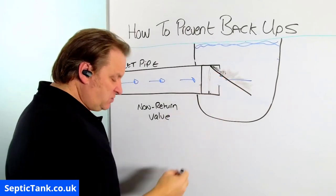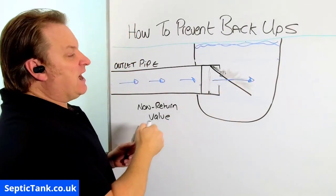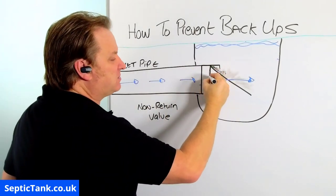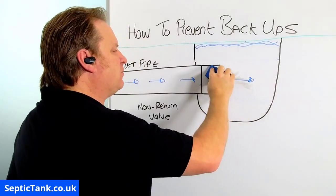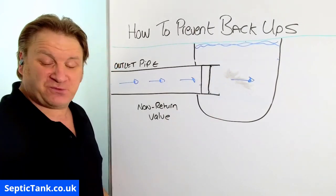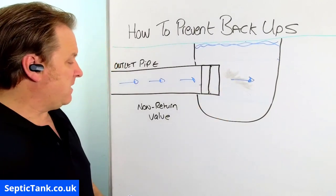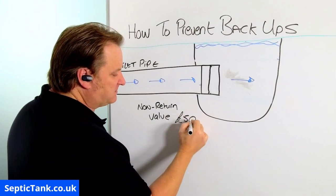However, when you have a bath or flush the toilet, the water coming from your property through your system is always greater than the water in the ditch or stream. It will open the flap, counterbalancing the pressure of the water in the ditch, so your water will leave your pipe, leave your house, and make its way into the ditch. Then as soon as that pressure wanes — when the water level decreases or the water dries up in the pipe — the cap flap will shut again. That flap will save you so much hassle, time, and money; it'll save you having to spend two or three thousand pounds on new bearings, shafts, and a new compressor for your sewage system.